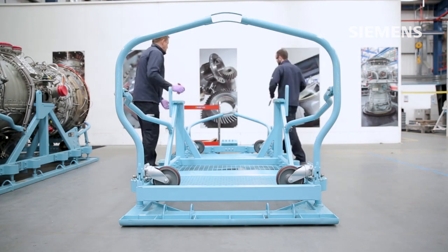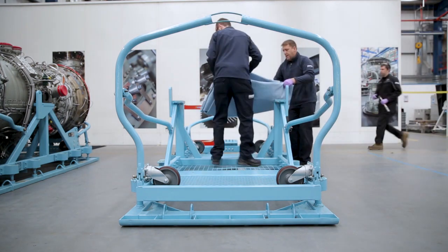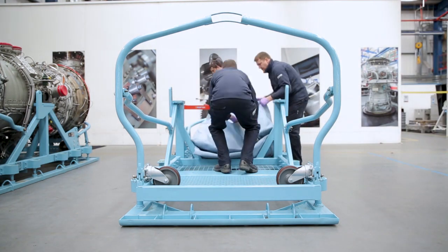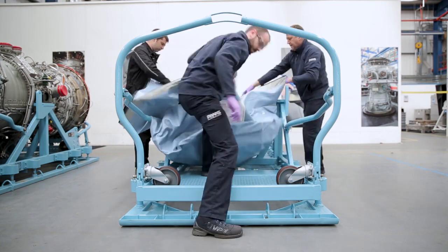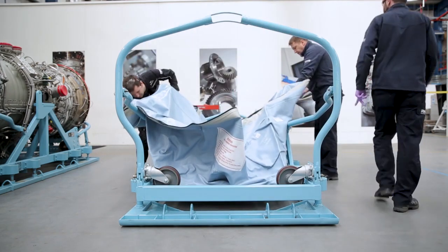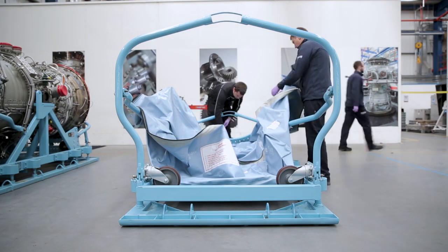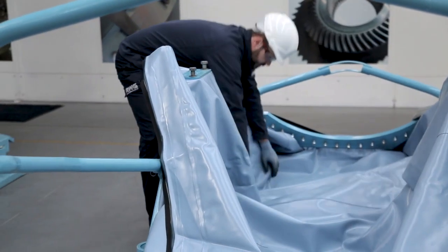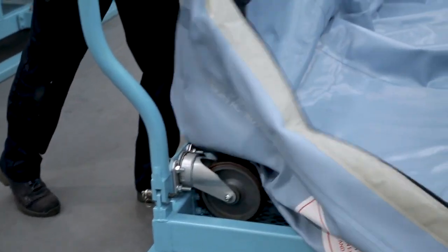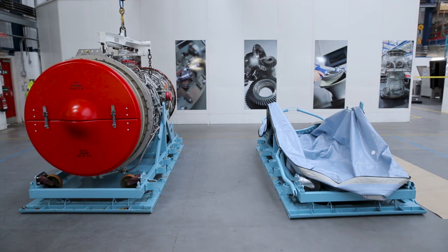Remove the MVP bag securing plates and rear mount and place the bag in the transportation stand. Unfold the bag and check for any damage. Secure the MVP bag into the stand using the side plates. If damage is found, contact your regional technical support team or the operational service desk. Remove the front, rear and side guards to improve access to the transportation stand.